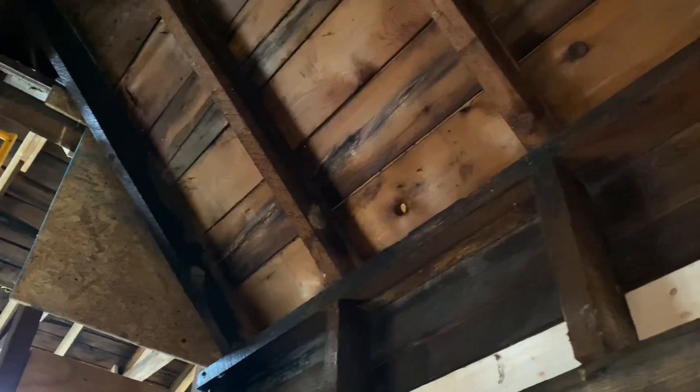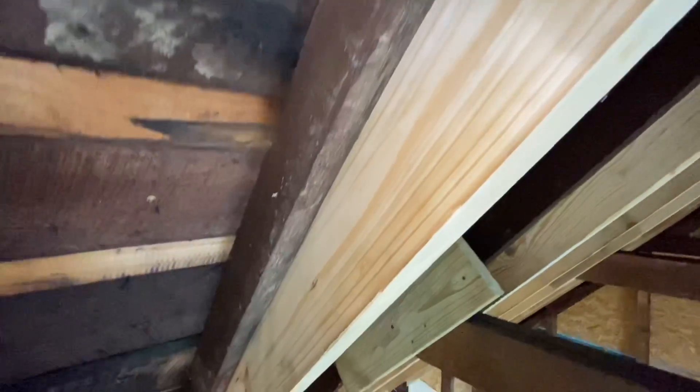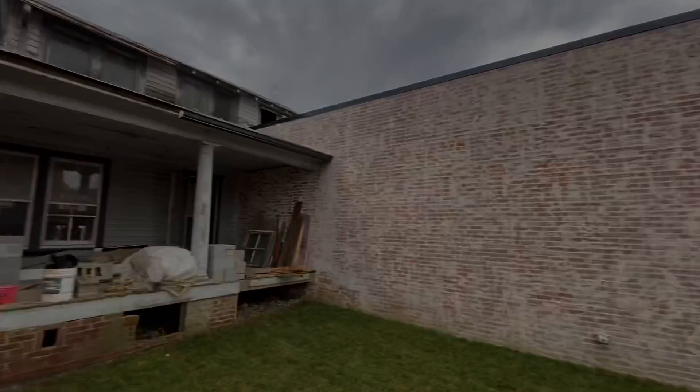Next let's talk about the rafters. Every rafter in this house was made of two by fours and you could see that over time they had sagged almost an inch or two inches in the middle of each span. So we used these two by eight yellow pine to sister against each of the two by fours. That allows us to push up and take the sag out of the roof and get a depth of insulation for spray foam. Now it looks all pretty now that it's done with two by eights screwed to every piece of two by four in this roof.